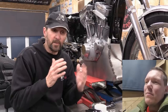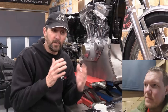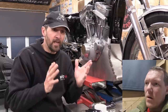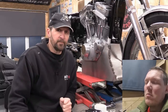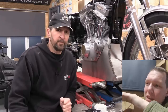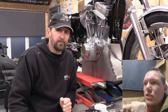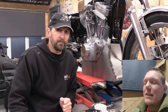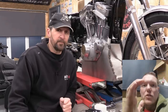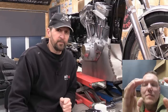This is metal, and you've melted it. So, yeah, no. It's solid metal all across that joint, and I can grind it round and smooth it out without, whoa, a gap. Whoa, you've got to remember, this is what, 1 mil thick? You don't try and, again, right, you don't try and grind any of this. If you wanted it to have a rolled edge, then you roll the edge before you weld it. So you'd make two sides that look like this, and then your front scoop bit would be just flat metal, and you'd weld it, trap it in between them, yeah?